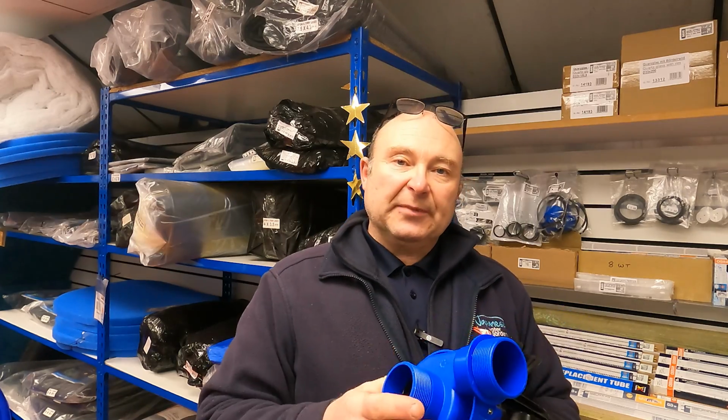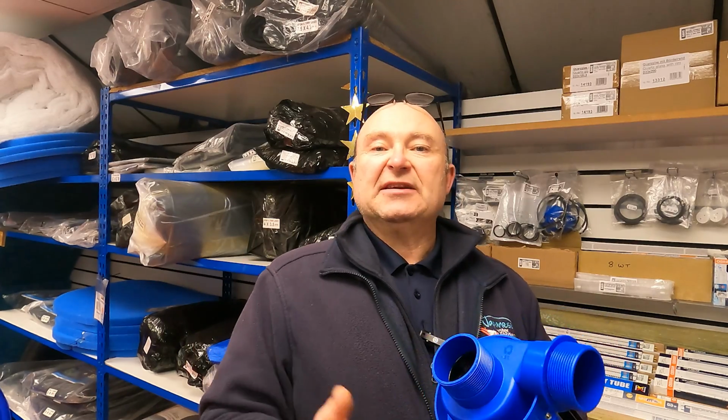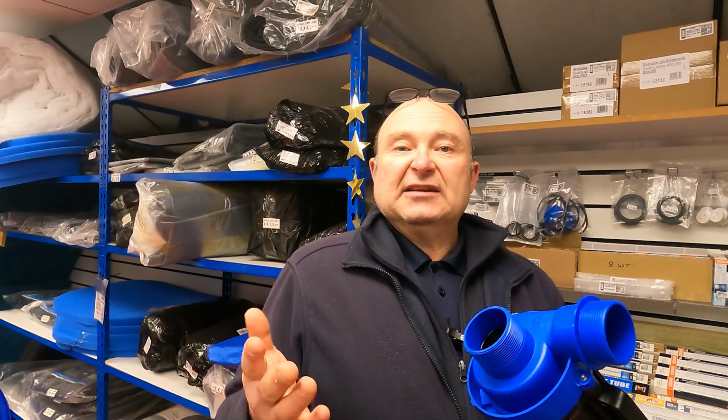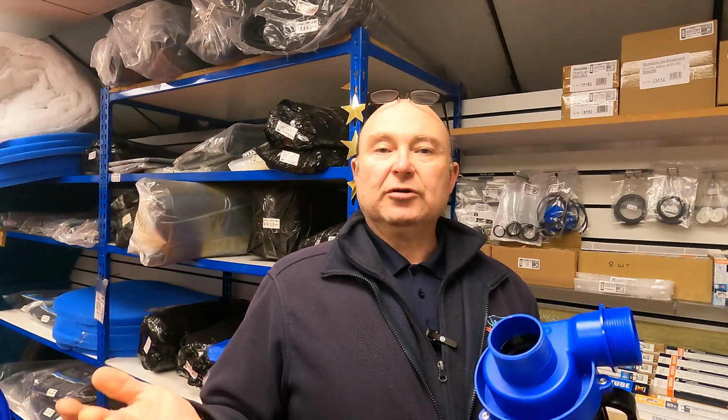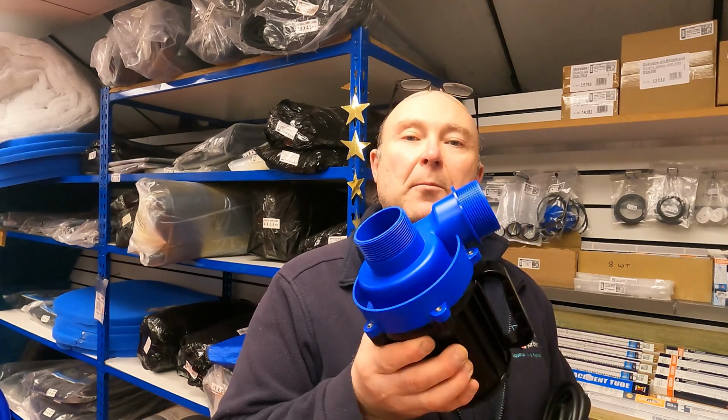And you're never going to be able to make the real savings, because you'll have the pump running at 100% to get the flow that you want, when in reality, with the right pipe work, you could probably have it running at 50% electric consumption and save money.